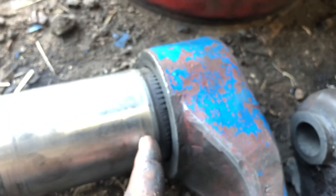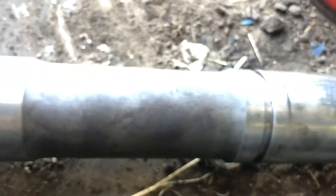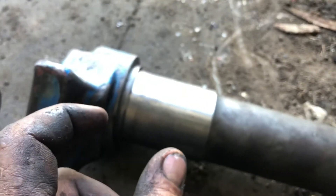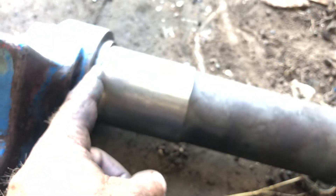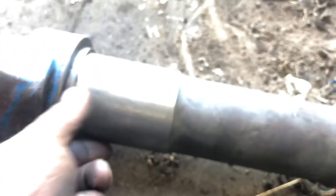There's a thrust ring that goes over this edge right here, and then there's a washer that goes up against there - a wear washer - and then the o-ring would sit right here. If you were to simply remove this yoke, you could easily push the washer out and then with a pick remove the o-ring, put a new o-ring in, new washer, slide it back together. First you take this one here and you can literally stretch the o-ring over this part right here, and with this slid over you could pick out the o-ring, jump the new o-ring over the washer, slide the o-ring over here, grease it, and slide everything back in.